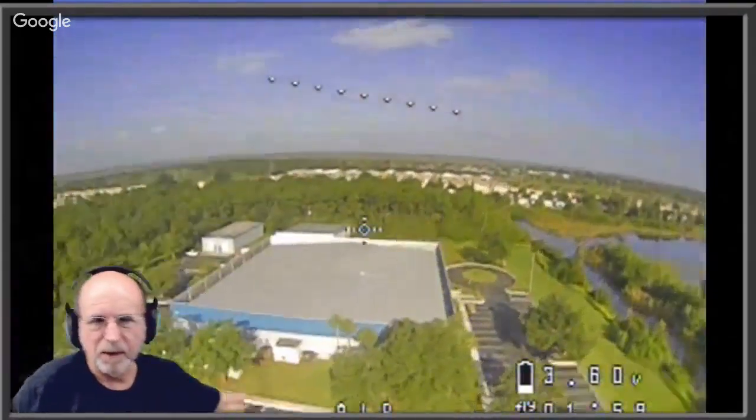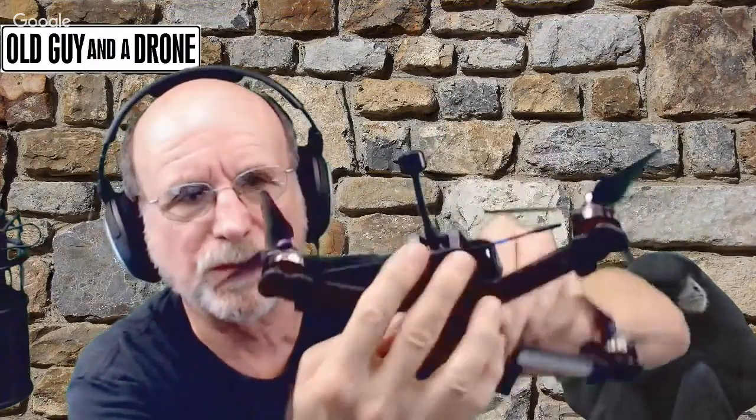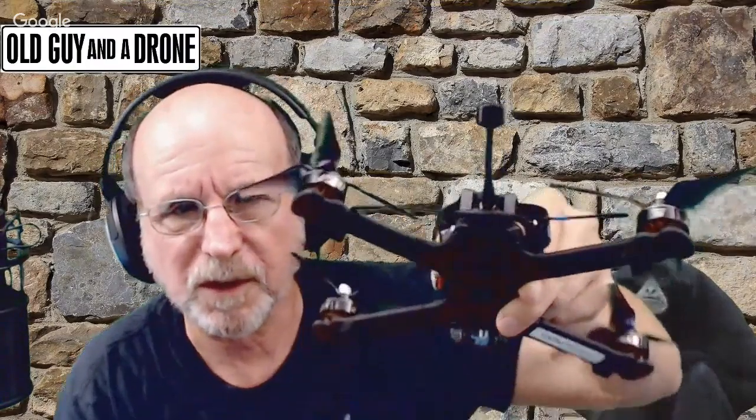They've got a T antenna sticking out the back. And on the Marmot here, you can see in the back, right here is the antenna. It's a T. See it? It just sticks right out the back underneath the VTX antenna. And when I fly this thing, it hardly ever moves off of 99% RSSI. It's just a monster. Not that I really built it to do long range stuff, because where do you fly long range, legally or whatever. But I like the option of being able to fly and not worry about running out of range. And this has got an 800 milliwatt transmitter in it, which really, when you turn it up all the way, gives you great signal.